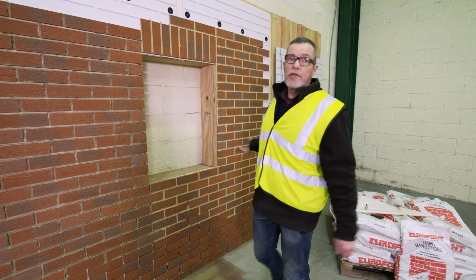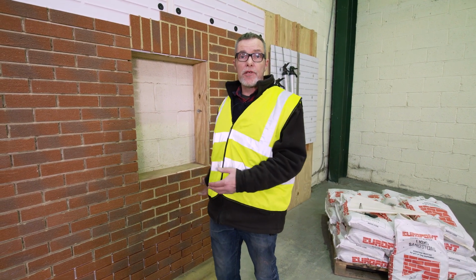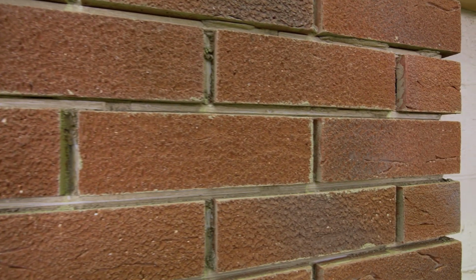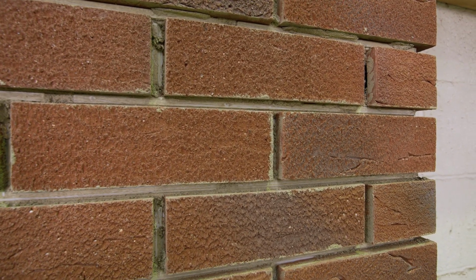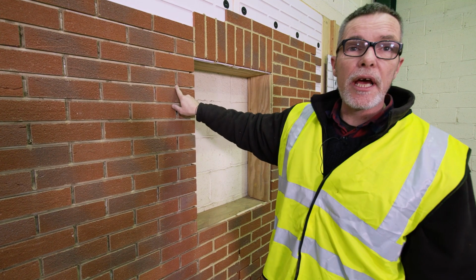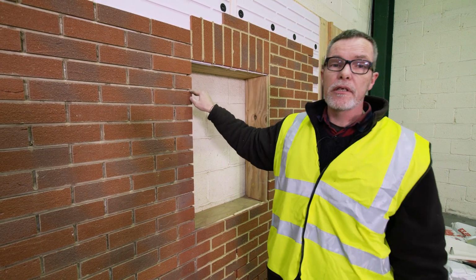So this small wall is the Eurobrick training wall where people come to do training courses and learn how to put the system together. In this particular installation, brick joints are fairly consistent 10mm beds and perps, so we need to think about keeping the brickwork as clean as we can by keeping the accurate placing of the mortar into the joints. That's something I'll come to later.